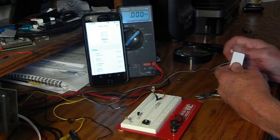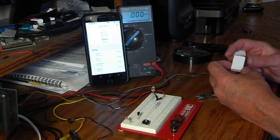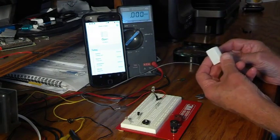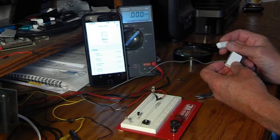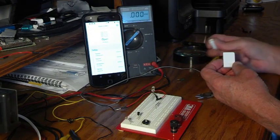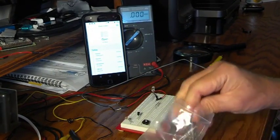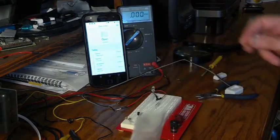Battery-powered, they utilize a bridge that's plugged into the back of one of the cameras. They also make motion sense PIR sensors, battery-powered also. This one comes with two pieces — the magnet and the transmitter. It's got a simple reed switch inside. You mount one element to the door and one to the door frame; when you open the door, it breaks the contacts using the reed switch. That is a magnetic reed switch, and that is what's inside the Wyze Sense.